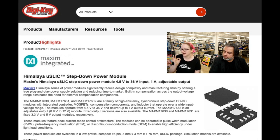All you really need is two capacitors — input capacitor and output capacitor — and if you have the adjustable version, maybe two resistors to set the voltage using adjustable resistance.